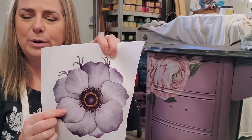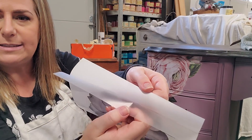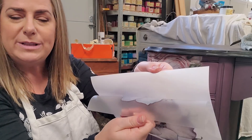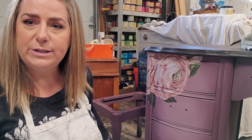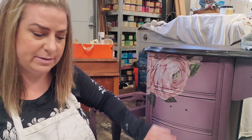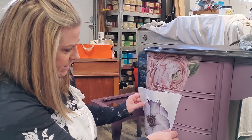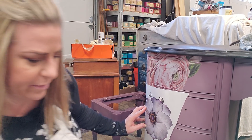I really like the look of these bright greens up against my purple. The transfer comes in two sheets — a white backing sheet and then a clear adhesive piece, which is what the transfer is actually attached to. Once I take off the white backing sheet, the transfer will attach to whatever I put it on. When applying a transfer onto a painted surface, you want to put it directly onto raw paint — no clear coat or wax. I'm going to roughly place my transfer and want it to wrap the corner of my furniture piece.